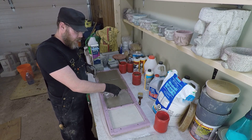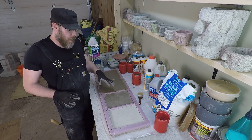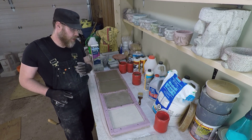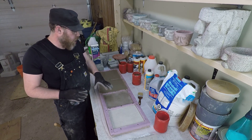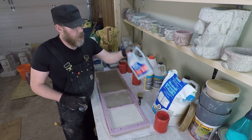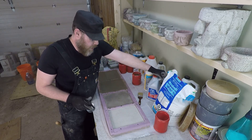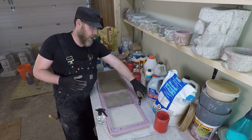So that's what I'm going to be doing here, and in order to do so I need to wet this concrete down. This has already been prepared — acid washed, cleaned, neutralized with TSP, cleaned again. This is how you properly prepare concrete in order to bond the new concrete to the old concrete. With this product, the PVA or Weld Bond, it calls for ten percent of the product by liquid volume.